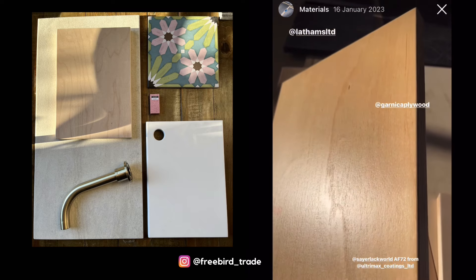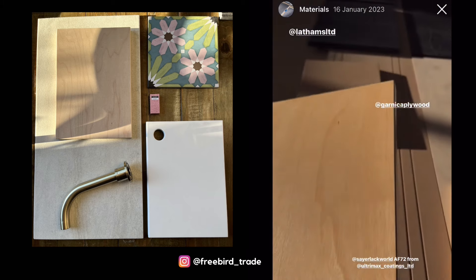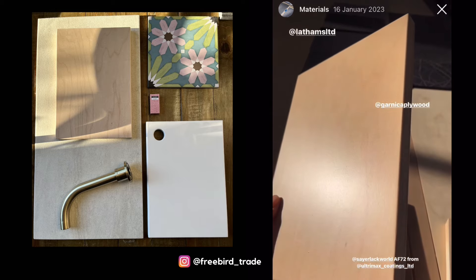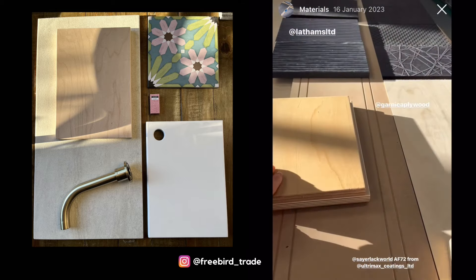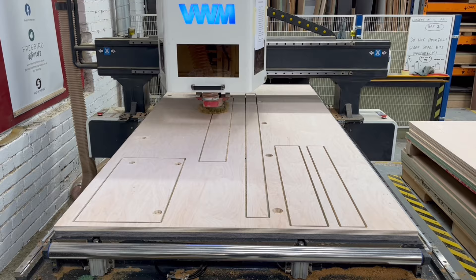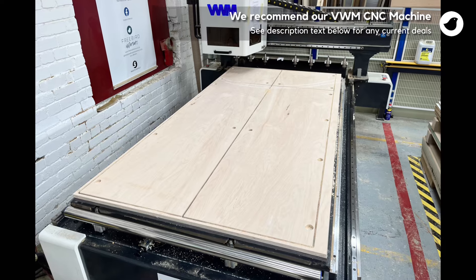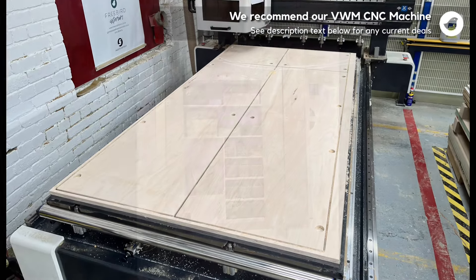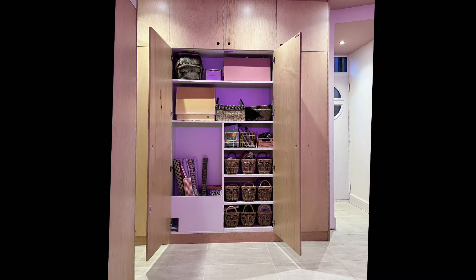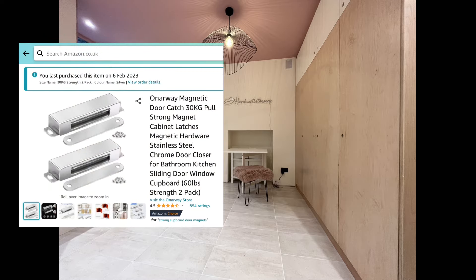Here's a quick comparison: the birch plywood is a bit pitty — it's a natural material, which isn't necessarily a downside — but by comparison the new maple board looks quite different at the edge. However, both materials are very prone to warping when used as tall doors. I'd warned Joanne and Tim about the likelihood of this ahead of time and we'd priced a contingency option of retrofitting door straighteners. In the end they decided they were happy with strong magnets from Amazon.